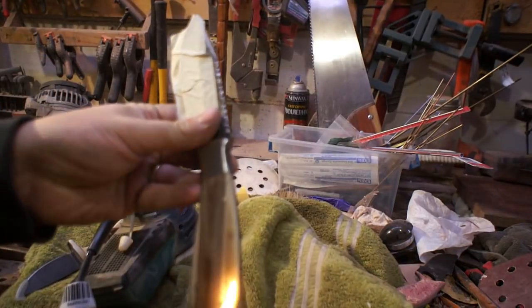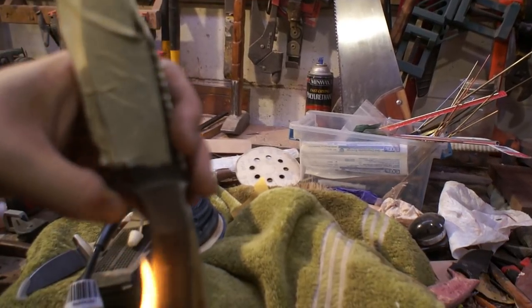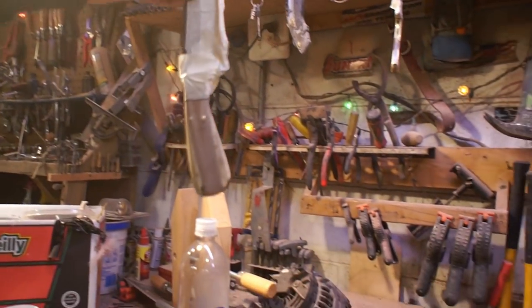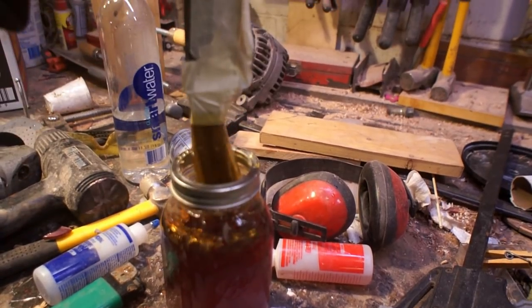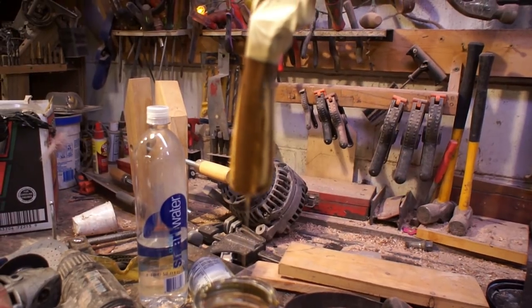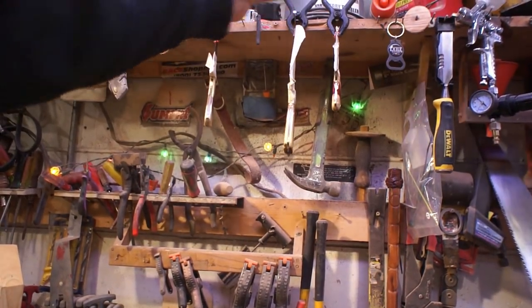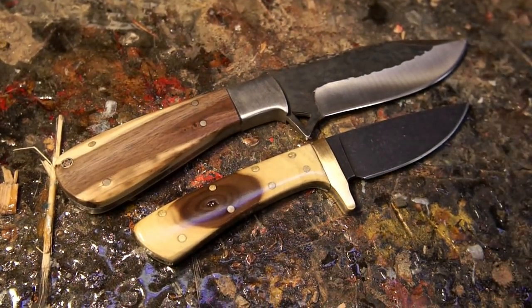As I got looking at this knife I did not like the contrast as much as on the first one, so I decided to do a light burning on the wood just to tone down the real whiteness of the sapwood. I started out going to use the same finish as the first knife — just dip it in polyurethane — but what I end up doing is putting some paint thinner on a regular paper towel and wiping it off, almost like a wipe-on poly. It still gives a shiny look but a little flatter, and it'll protect against moisture. You can see them right next to each other here and how that finish came out.